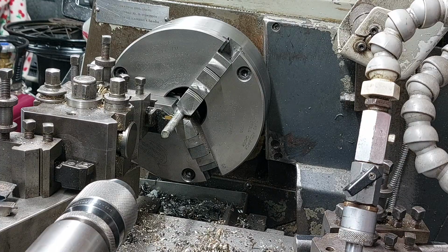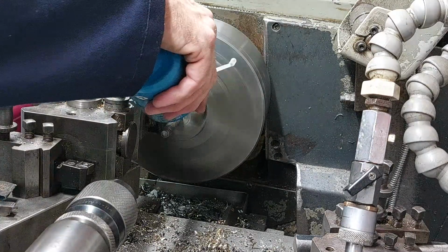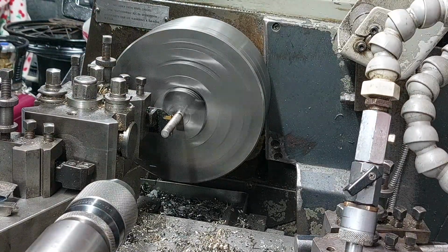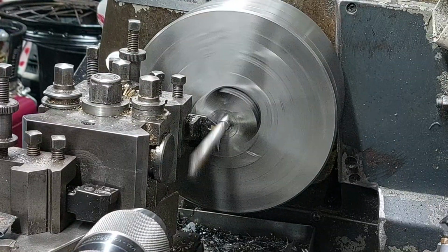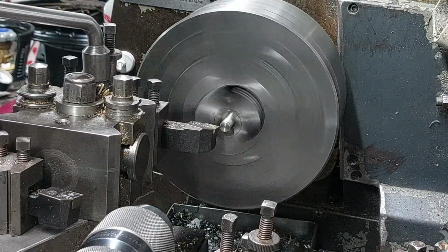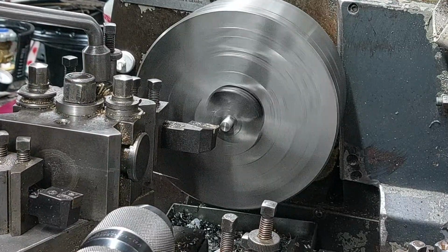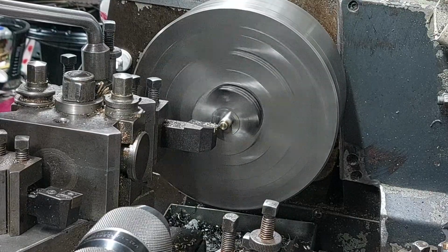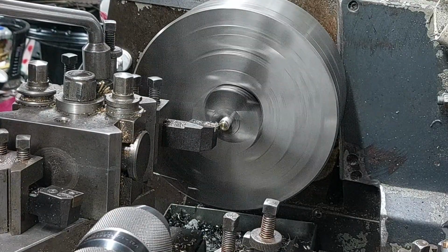I've got this old coach bolt that I think will do. Cut it down a bit, I didn't need all that length on it, so I just parted it off. And then turned a little shoulder on it, so I had a locating peg on the end, just under 6 millimetres, to go in my location hole on the pressure pad of the compressor.